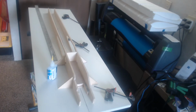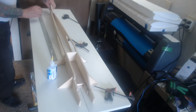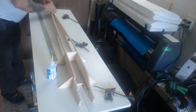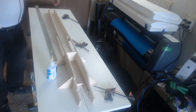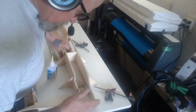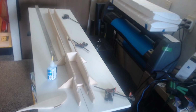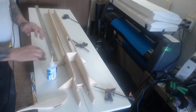Okay, so the subrudder sticks back approximately 4 inches behind this, right there on that line. We're going to have to add a 16th on the tail post, so I need to figure that out. A sixteenth on the tail post so that it's wide enough for the subrudder. Now where's my little square? Here it is. Need a bigger square.